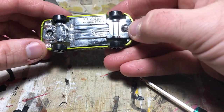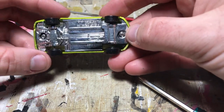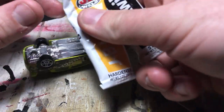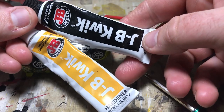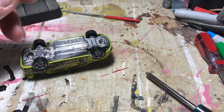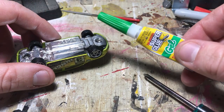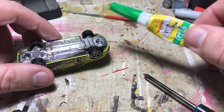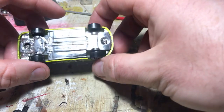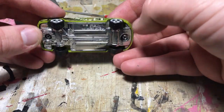Alternatively, if you didn't want to use screws, you can drill out the rivets and then use something like JB Quick — it's just a fast-setting version of JB Weld, which is a metal and a hardener. Or you can use super glue — I prefer the gel for this particular process. You can also use a two-part epoxy. Pretty much anything that's sticky and long-lasting will work to hold these together.